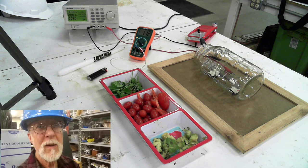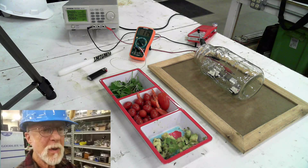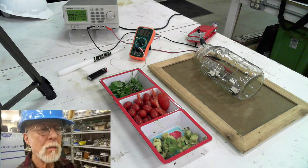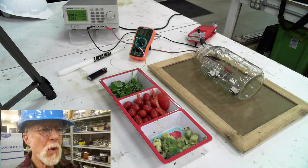As you mentioned, your color calibrator, some people got a chance to watch that earlier today. It was quite a fascinating experiment, and right at the end we had a really big bonus, didn't we? After it cooled down, we took a close look at the materials, and the first thing we noticed was the high emissivity coating, which is rated at 1,000 or 1,100 Celsius, does indeed change. At even a lower temperature, as it ages, it changes color from a black to a greenish tint. And you can see the progression of the temperatures across the test bar by the color increments.